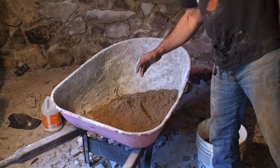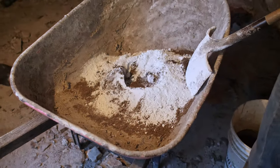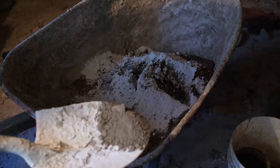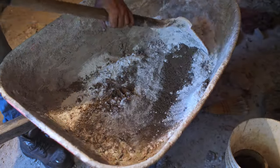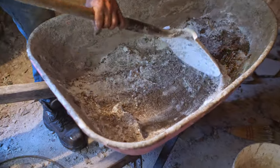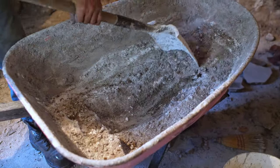Let me show you what the process is. I've got three shovel fulls of masonry sand in my wheelbarrow and I'm putting one shovel full of white masonry cement into the mix. Before I mix that, I'm going to grab just a wee bit of Portland cement — that just dirties up the white, makes it a little bit less pristine. Dry mix that. The three-to-one ratio is what I use. This is what I call a half batch — I typically do six shovel fulls of sand and two of cement. I'm just doing a half batch for the purpose of this video; it goes a little bit quicker.